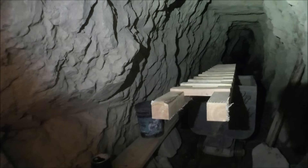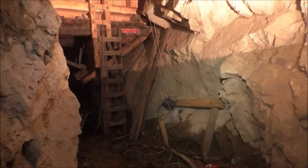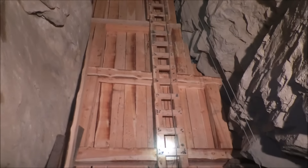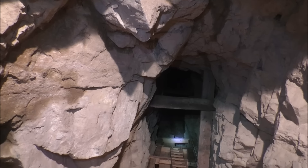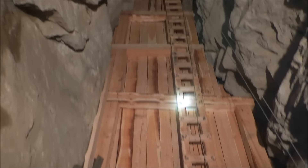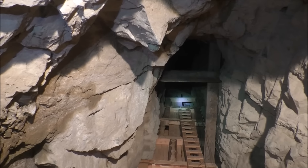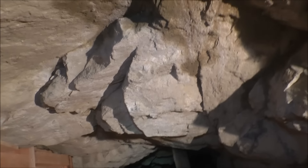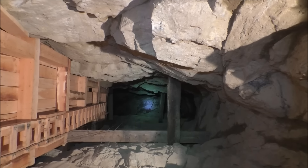So this is a ladder we're using to restore the ore bin in the number one shaft. We're 400 feet back. This was originally a three-compartment shaft, with an ore bin on that side, and we're rebuilding this ore bin. The ladder's going all the way up there to a level about 60 feet above. We're using ropes to go up and down these ladders for safety. Normally the ladder would only go up about 15 feet to a platform and then be offset, so it's not usual in a mine to have a 60-foot ladder going straight up. The reason we're doing this is because we want people to be able to see up the shaft. Looking way up there, you can see the 2700 level 100 feet up.